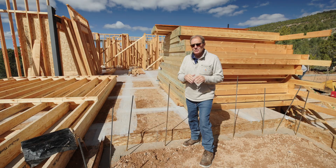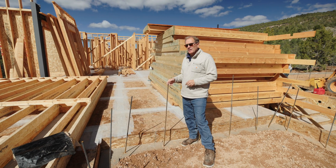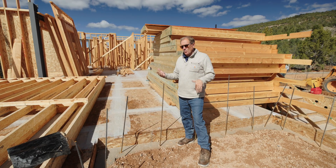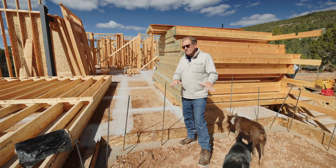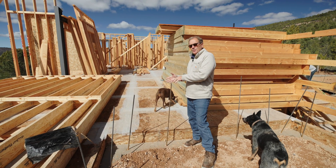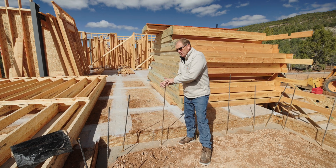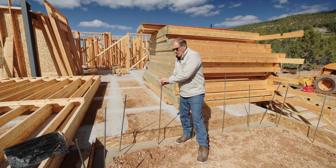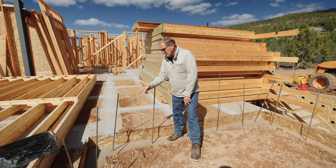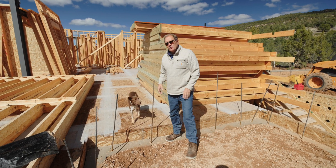This is a question that a lot of people just never really talk about. I frame first, and I think that's probably the best option for a lot of people. Why? Because if you pour this slab, it's much more difficult to frame exactly to that. With this approach, when we get ready to pour the concrete, we'll bend all these down and you can actually get a level ground. You can literally take a level over there and get your concrete just perfect.